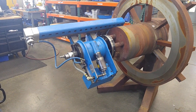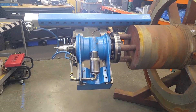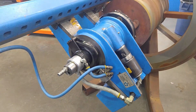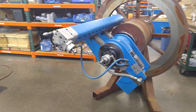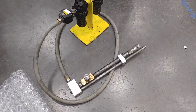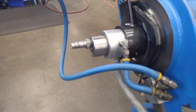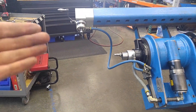Hey there everyone, here's a quick tech talk on the model PL4000 portable lathe. This is the largest of the three portable lathes that Climax makes. This is an all pneumatic powered machine, so the rotation and the feed is run off of the air system. The air system is supplied through the pneumatic conditioning unit and this set of rigid pipes that plug into the back of the rotary union and from there it sticks out the back end in clearance of the turning arm.